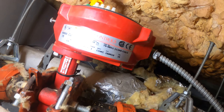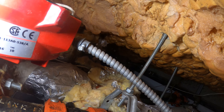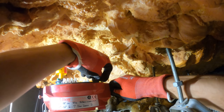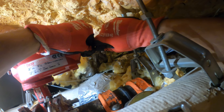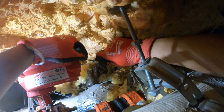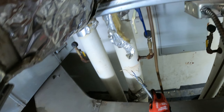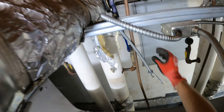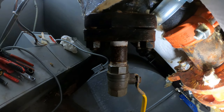The insulation is taken off. Here's the valve and electrical. I took a picture of the wiring. Let's take off this BX cable — we've got three wires. Disconnected the three wires at terminals one, two, and three. Let's pull this out. I checked for power first — everything is safe. So now we can move this to the side and begin taking off this valve.